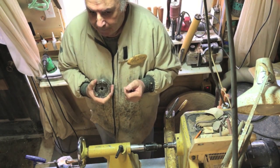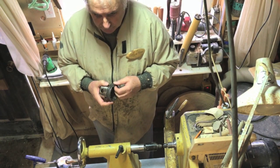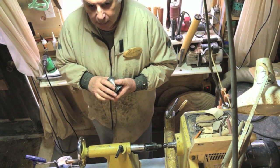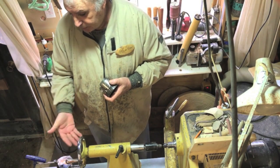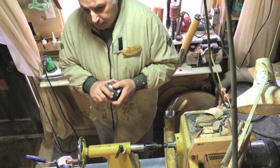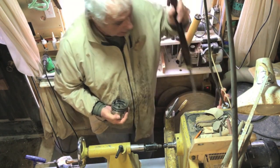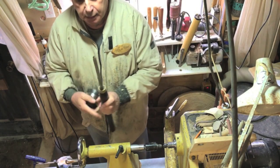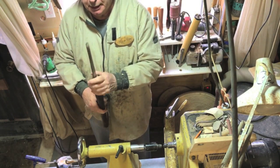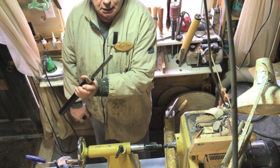I do shearing cuts with the skew to tighten everything up and clean it up, then I'll put the chuck on the piece of wood, lightly tighten it, and look in the little cracks to see that I've got good contact with the whole dovetail before the wood goes on the lathe. Then put it on the lathe, bring up the tailstock, and do a final tighten on the chuck. The tailstock pushes it tight on that shoulder and it grips.